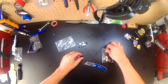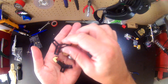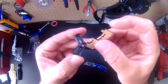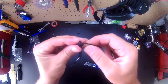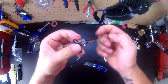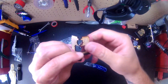You'll also get a jig. Don't even try to build this without the jig — it's a pain in the butt. The jig comes in five pieces: a top and bottom plate which are identical. The biggest thing is that using this jig is what makes it stay in tune. That's the one thing about Pagoda antennas — if you don't get them at the right height, the frequency changes and they won't work.